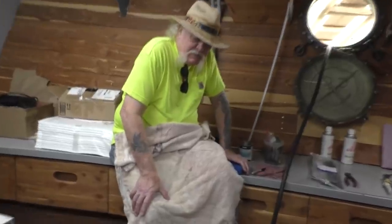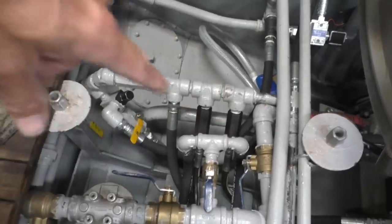We're ready to test the hydraulic system with pressure from the pumps. Bert's standing by. Are you ready with the towel, or are you just protecting yourself? I'm protecting my pants. So I've got the aft and the forward valve shut off, so all we're going to do is pressurize this portion of the system. If that works, we'll start opening up the rest of the system.